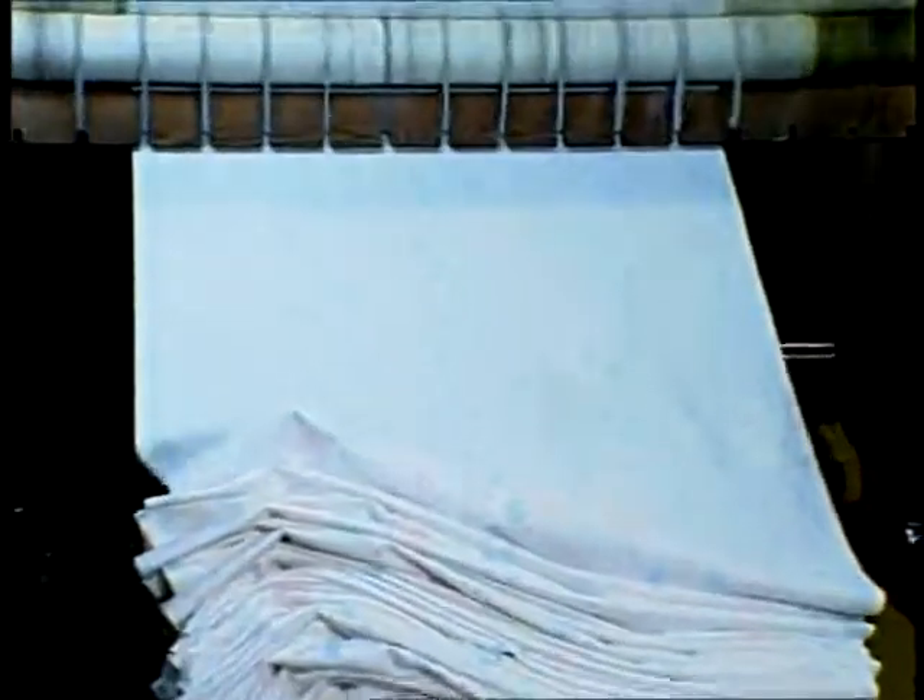The high fixed cost of copper rollers, the expense of the engraving process, and the possible distortion of fabric during printing have led to its reduced use, now being less than five percent of the worldwide textile printing market. The fine design detail possible with this technique has always been its main advantage.